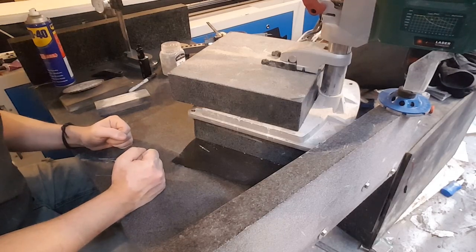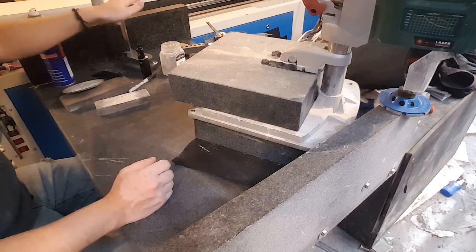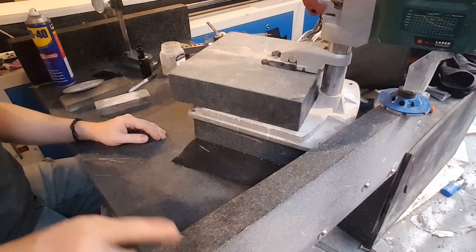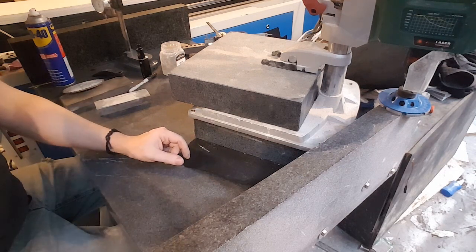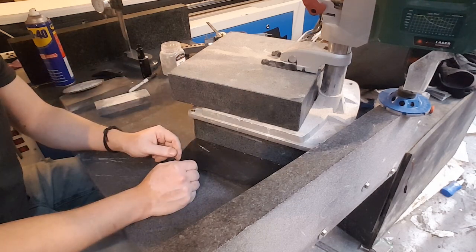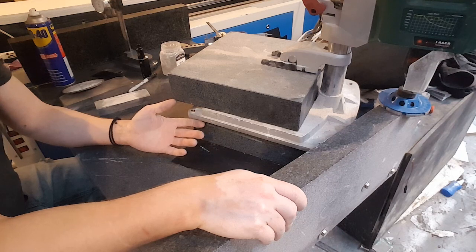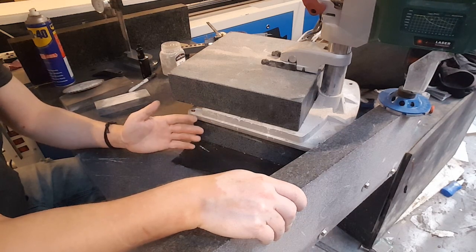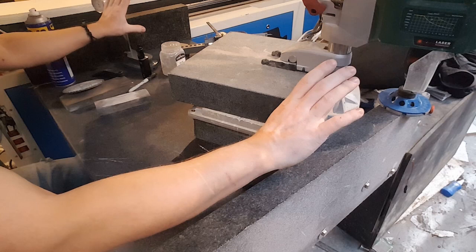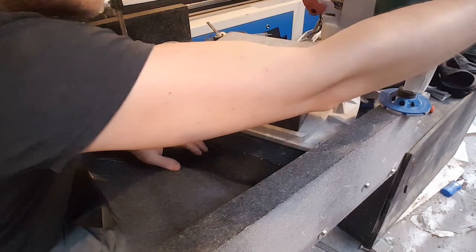It's gonna be slightly more grinding than that side. This one is 0.2mm too high here and 0.6mm too high here. I want to make it on the same level as the other one — it's not necessary to have it exactly the same level, but I'm just making it for the art of making it. I'm not sure if I can achieve it, but I'll try to be as close as possible, because when you put the gantry you can still adjust the gantry or sliders. Let's begin.